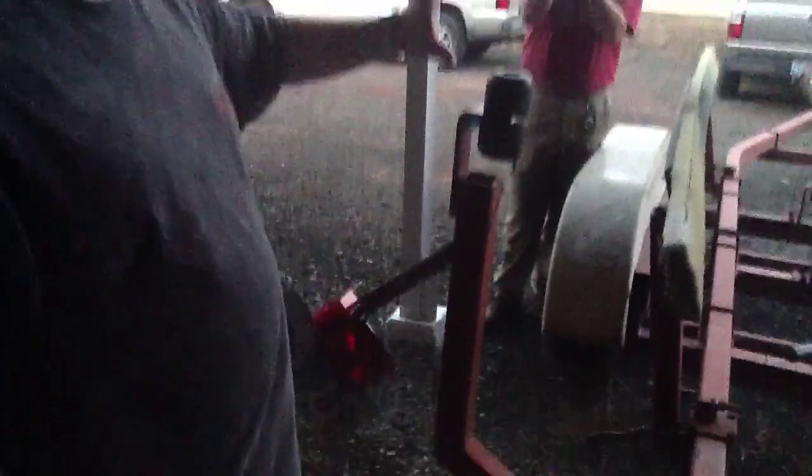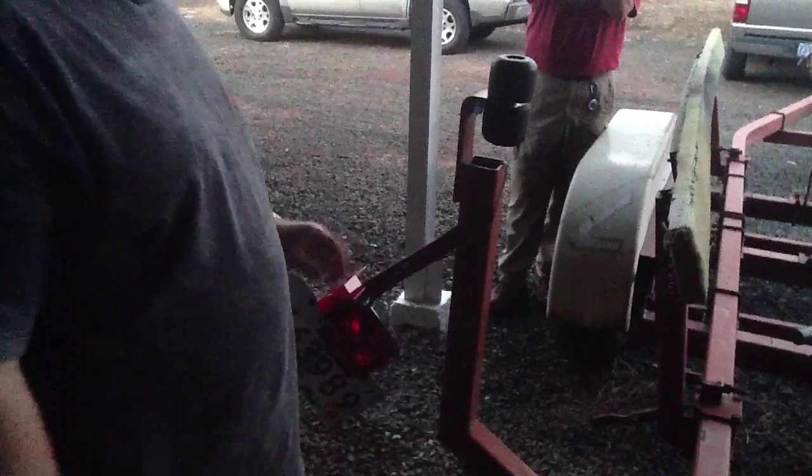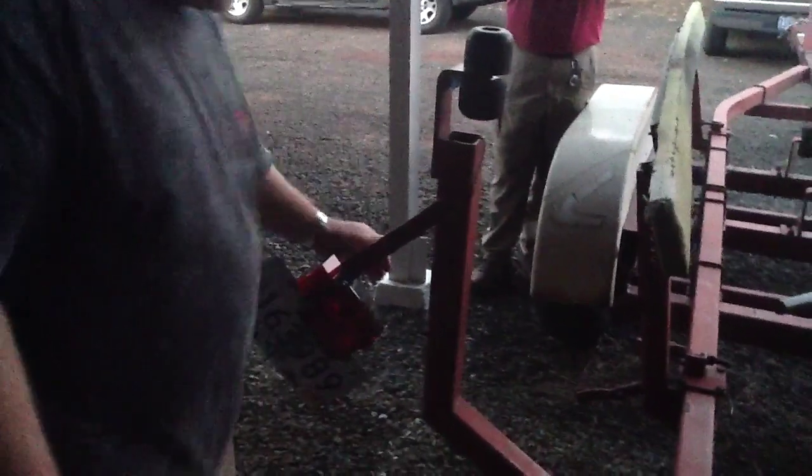They swing up when you're going to go in the water. You can pull these out if you're not in real deep water. I need to lubricate that. But they'll swing all the way up and stick up here, because a lot of times when you're putting the trailer in, the water's only this deep. So these lights can be up out of the water. You can float the boat off. You don't get all your tail lights all wet, which is nice.